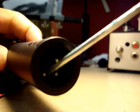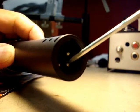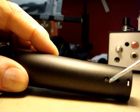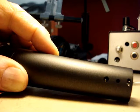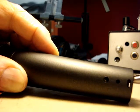I've slipped the XLR male connector back into the body of the microphone and I'm going to tighten it now. That'll be the second hole here — see how the screw is there. If I push it in too far it'll go down, so we don't want that. That's one of the caveats of these microphones.